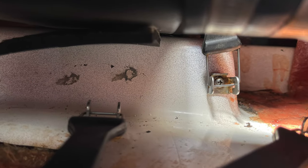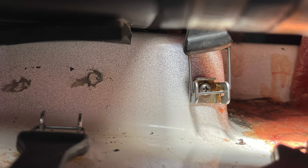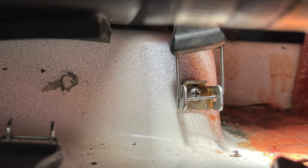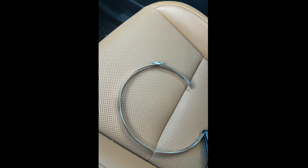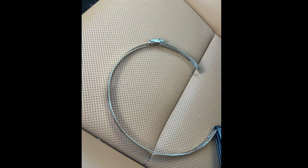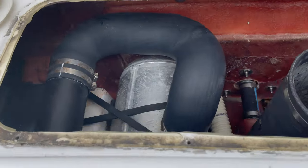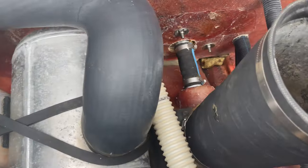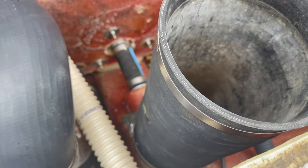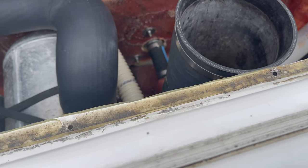All right. So we got that bracket mounted nicely on that side wall there. Always be careful before you drill, know what's behind it. And there's no problem with that. And now we are on the hunt to replace the broken stainless steel hose clamp. All right, so this started off as simply an inspection of my bilge area, and we rectified all of the problems with new clamps and so forth as described. But now I'm on to a new topic.